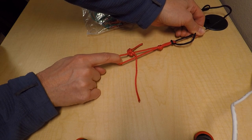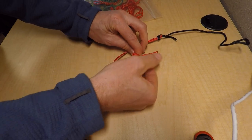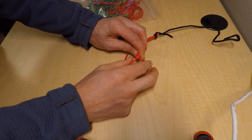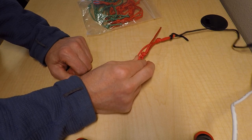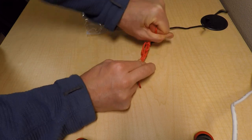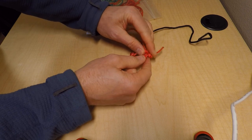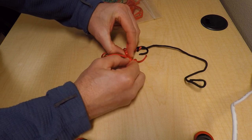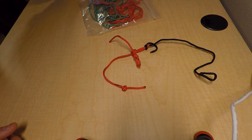It'll hold up real nicely while you're sailing. Then when you want to remove it, get a hold of your stopper knot, pull it out a little ways, and bend it back so you can hold both the stopper knot and the working end leading out of it. Pinch that little loop, grab the extra long tail on the slip knot, and give several sharp tugs — the slip knot opens right up. Pull it through a little more and you remove your shackle.